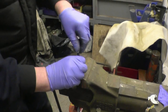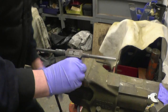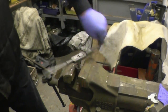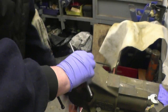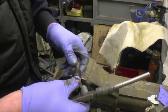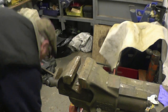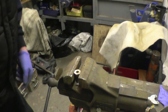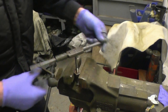The thread in these is actually 7/16 inch Whitworth. I'll put a tap through just to clean the threads up and make them shiny. Here's another one which is the same thread. The purpose of cleaning the threads is just to give the lead something to grip.